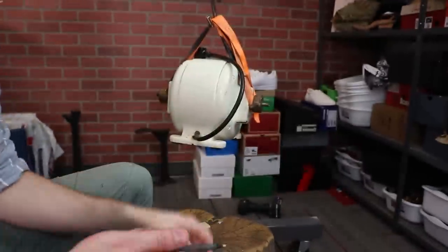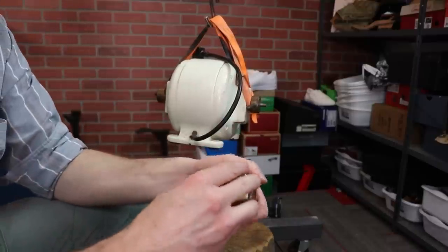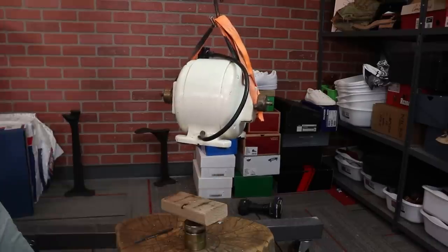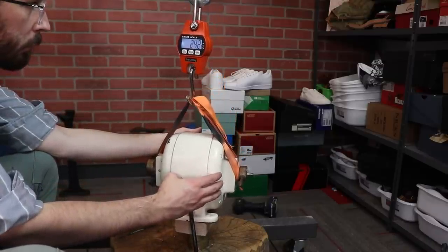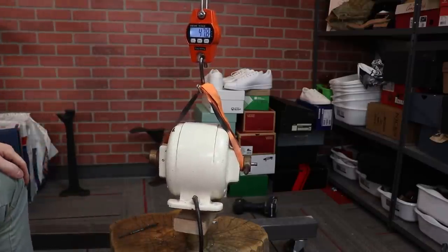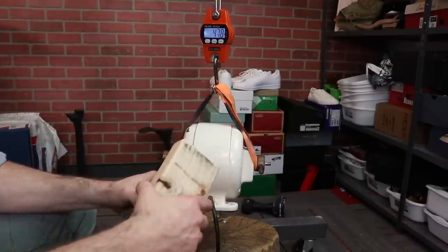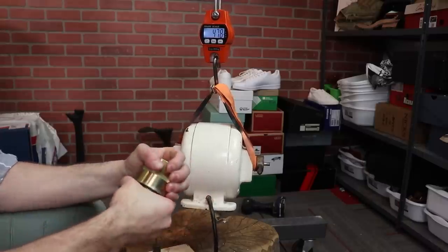First test: I cut a little circle of the outsole, pop it into the rig, screw the top on nice and tight — this one has the most opportunity to stretch — pop the guides in, line it up, and lower the dental lathe onto it. After reviewing the playback footage, it looks like it takes just about all 48 pounds available with the dental lathe to pierce through the outsole. That means we're going to need a beefier setup for the Kevlar.